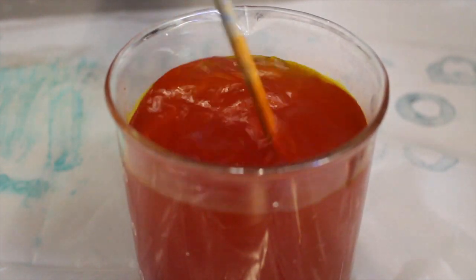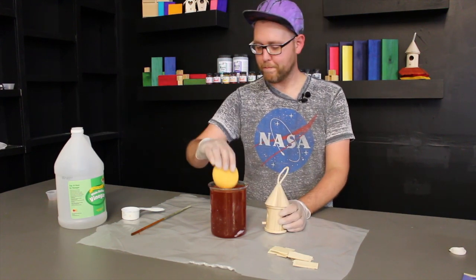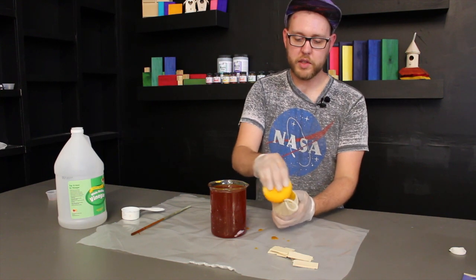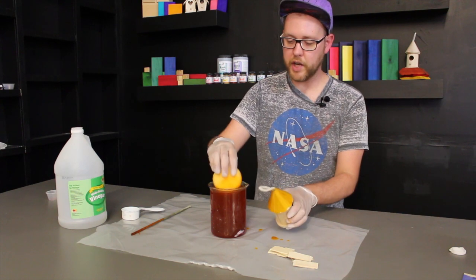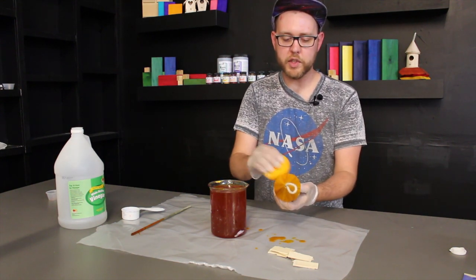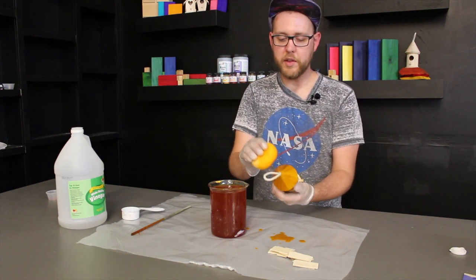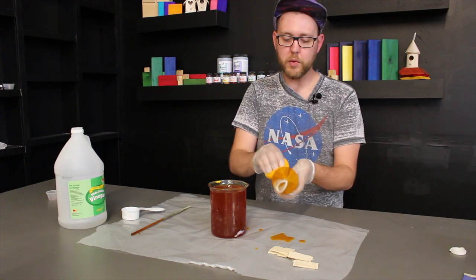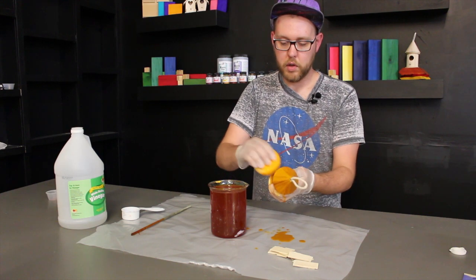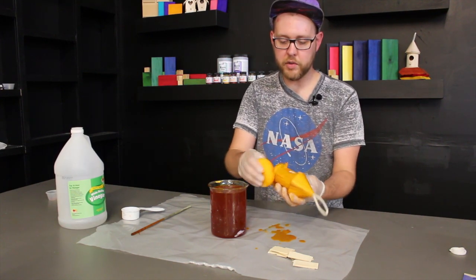I'm just going to use a sponge here. You can use a sponge brush or even paint it on with a paintbrush — any way to get it on is no problem. You just dip your sponge in the dye, soak some dye up, and then sponge it on. The dye has such a high affinity for wood that it immediately strikes on there and gets stuck in the fiber. This always looks really beautiful when it's going on while it's still wet. You'll probably need more coats than you think, because it looks awesome wet and then lightens up a little bit when it dries. It is amazing how fast this dye works — it's just incredibly fast. The golden yellow looks great on this wood because there's variegation and you get some variation in the color because of the natural color of the wood.